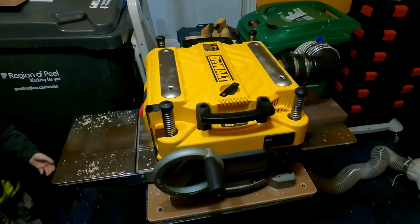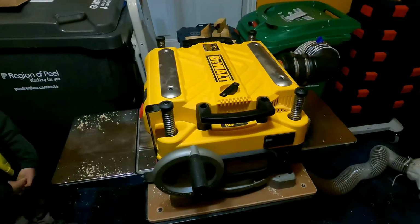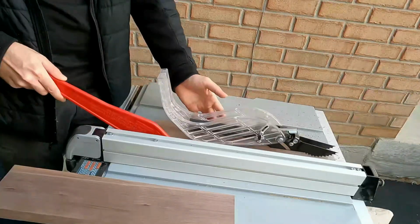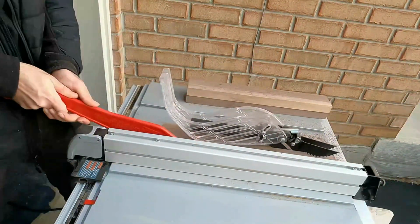However, I only managed to plane the top and bottom of the wood I milled, since the sides were too thin and tall and I didn't feel comfortable running them through the planer. So then I came up with the idea to plane the sides of it using my table saw. This way the whole thing would be perfectly planed, and it worked.